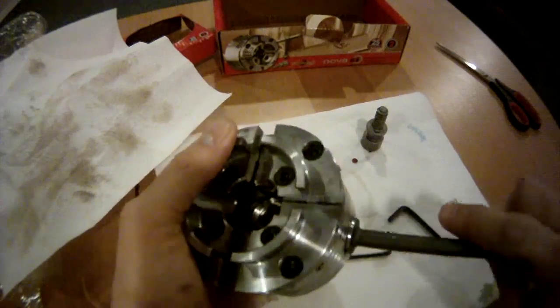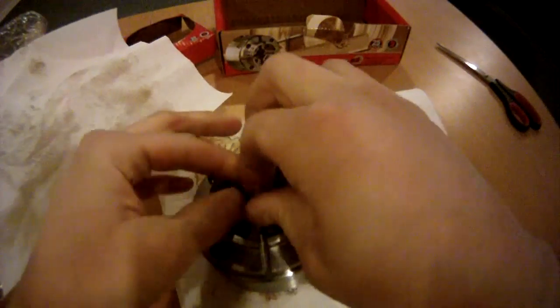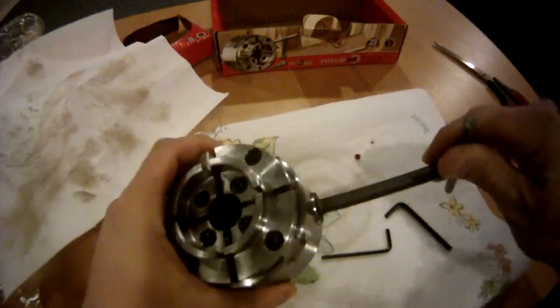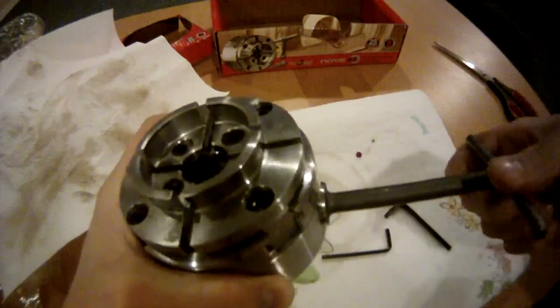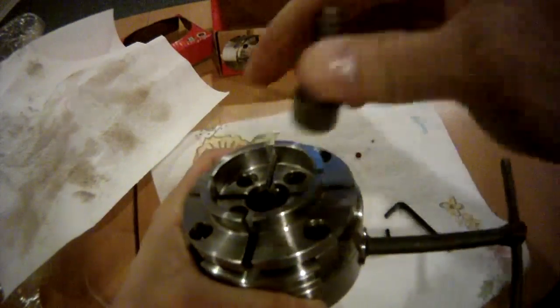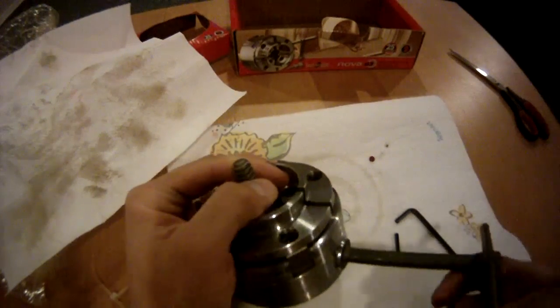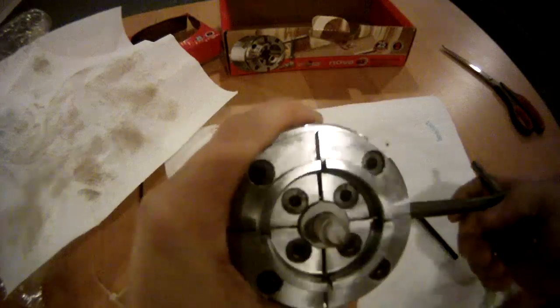Now as I collapse this down, I'm going to take this, and you can see where this would then be able to sit in here between the chuck jaws to be able to line up. You tighten this up just a little bit further so this is not too tight. And so now this woodworm screw can then just get locked into the jaws like that.